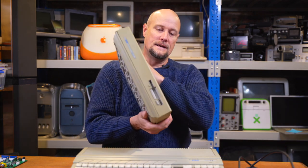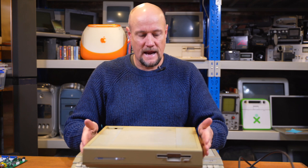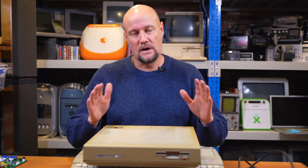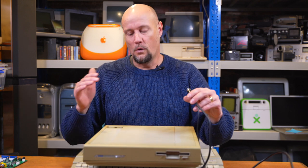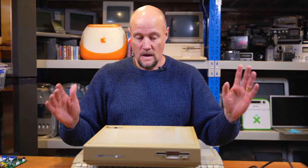The other reason why I'm combining horizontal and vertical sync and not using the composite output is because of this. I picked up the other day this Atari Mega ST. Now, given that it's a standard ST in a desktop case, it means it doesn't have a modulator, so it's not outputting any composite video. So the way I'm doing this cable is going to work also for older machines that don't have a modulator inside and can't output composite. That's a whole bunch of technical mumbo-jumbo to say I'm making a lead and a converter to get video out of this machine, convert it to VGA, and get it onto a monitor for any Atari ST device out there.